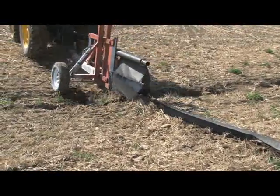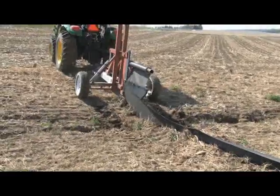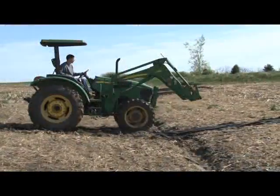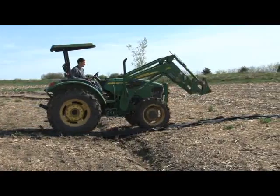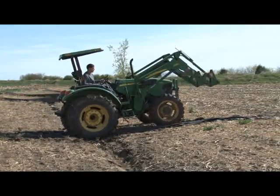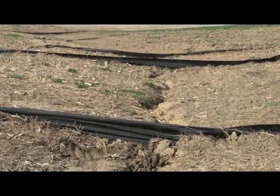One of the first questions that comes up relative to the installation of barriers is what is the cost to do this? With the cost of the fabric and the rental of a machine, generally speaking, the barriers cost somewhere between $20 and $30 for each one. The need for these barriers varies depending on the slope of the waterway — the steeper the waterway is, the closer together they need to be — but generally speaking, they're spaced somewhere between 50 and 100 feet apart.